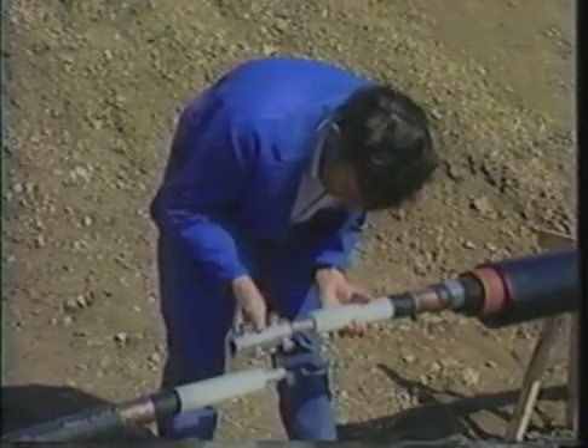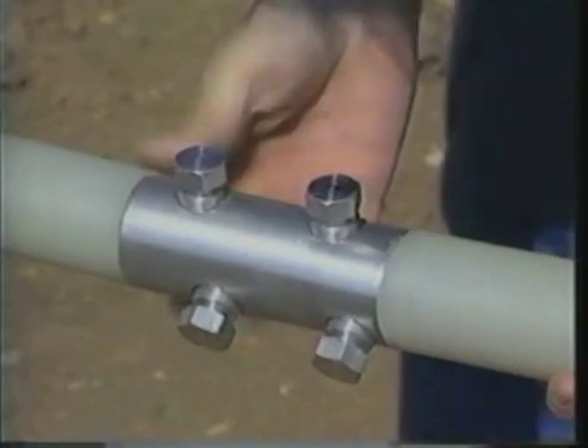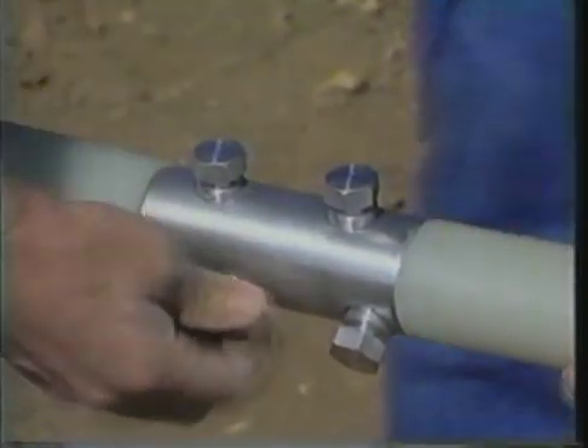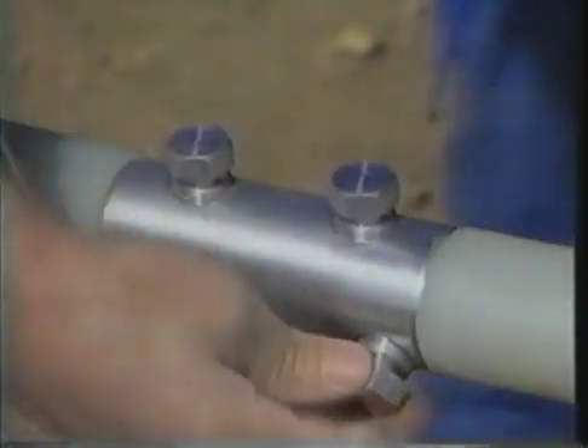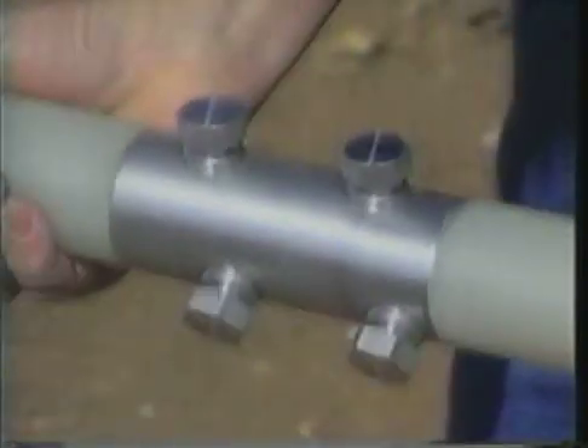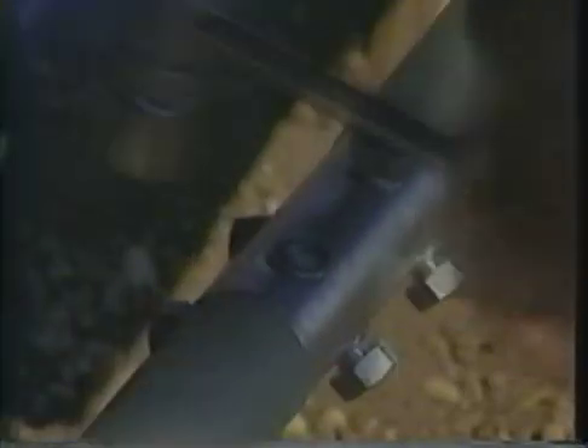Repeatable automatic installation of a pre-engineered wall thickness is one of the practical benefits of this technique. In addition, the Raychem solution incorporates an improved conductor jointing method. The connector is of the mechanical type, suitable for large cross-sections. Contact grease is supplied pre-coated inside the connector and the bolt heads are designed to shear off cleanly at the correct screw torque.